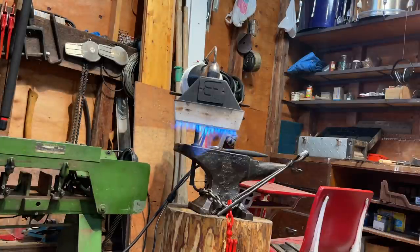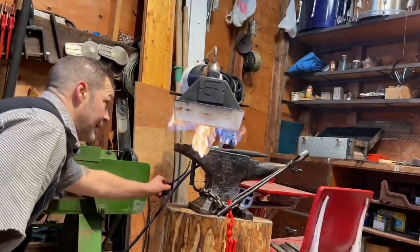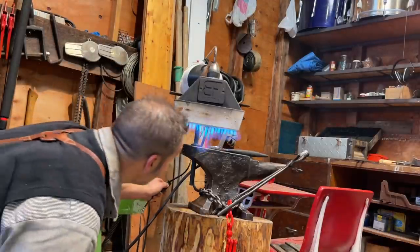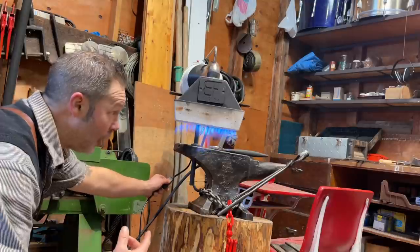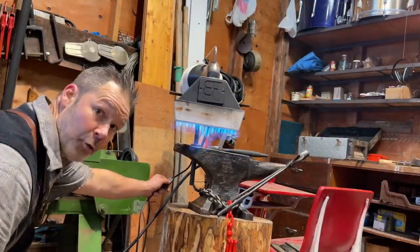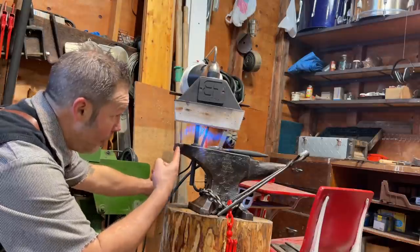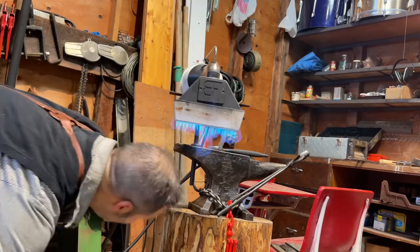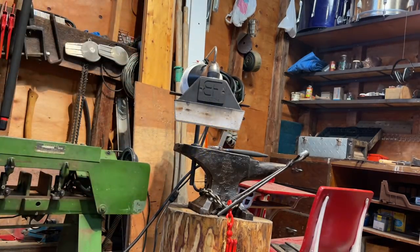Okay, so now I open up propane, so propane's opened wide open, and this is kind of how this sits, but give it air, see what happens? So this burner's working quite nice. Can you guys see? But too much air and it'll actually blow the flame out. You see? Two settings on the fan, so let's see. Yeah, see? It almost blows it out. That means the regulator needs to be turned up a bit. It just has to be. So I keep a little air going, just like that. See what I mean? Oh, there, it just blew it out.